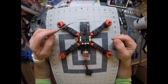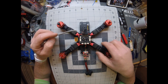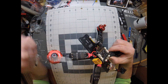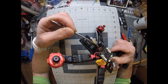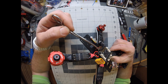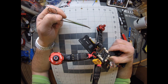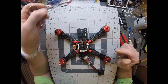Everything seems to be set up, seems to be ready. I'm not too sure about this plug right here, so I just went ahead — I needed five volts, I know these put off five volts. All of the middle pins are five volts, and all of the bottom pins are negative. So if you need five volts for something, you can just tap into any of these pins and get your five volts. I'm just tapped in here for my cam — just soldered the connections on there, and that will work fine.